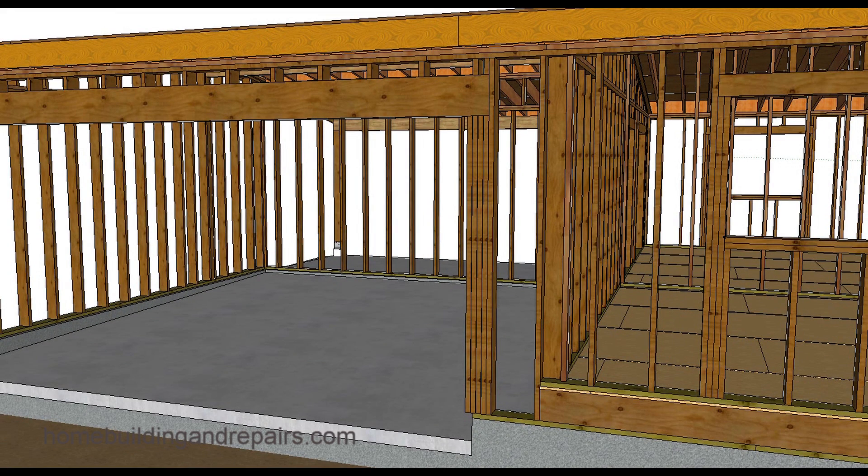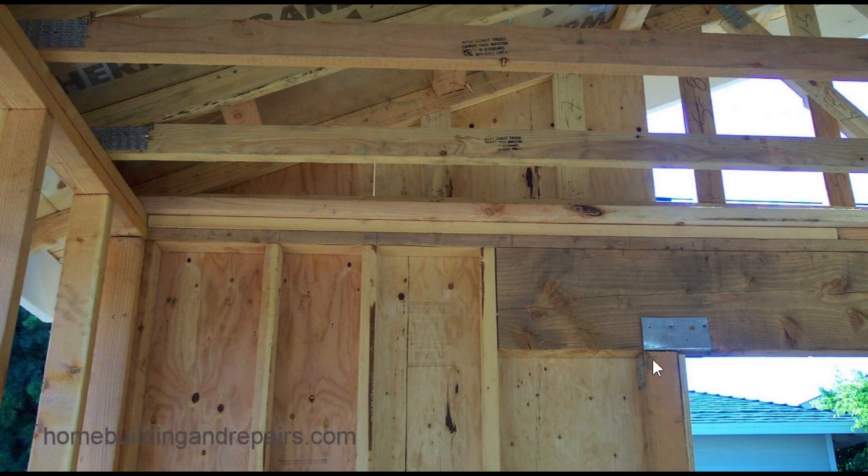I hope that makes sense — I definitely ran into this problem more than once. Something else I'd like to point out is that I rarely ever cut garage headers. I usually extend them over. Here's a good example: you get an 18-foot beam, flush it up on one side, and run it over to the next stud. The stud can always be laid out to the length of the beam — if the beam is 18 feet, simply put a stud in there.